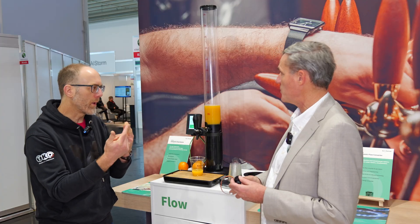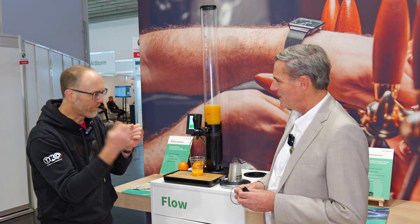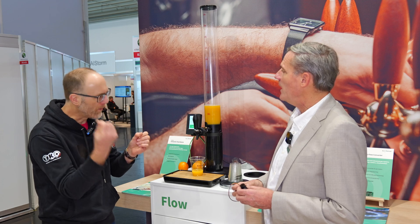With this ultrasonic technology, we send an ultrasonic burst with the flow and against the flow. The time difference is proportional to the flow rate, and by this we can calculate the volume. The great advantage is no moving parts. The second advantage is it's very precise, much more precise than the mechanical meter. So we can measure very low flow rates, even down to a dripping water tap. Leakage detection is also a big advantage, where a traditional turbine has problems because the flow is not powerful enough to turn the turbine.